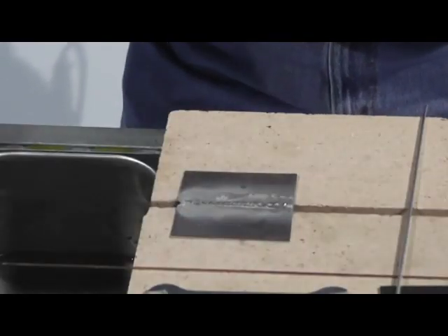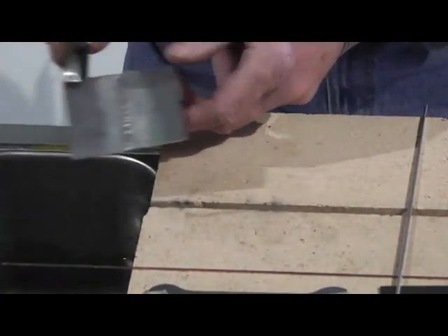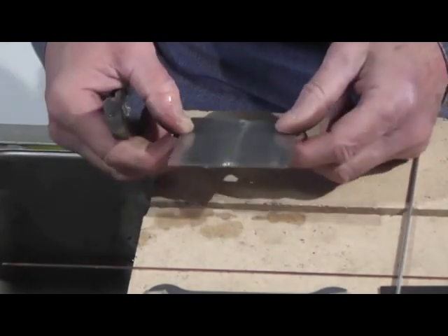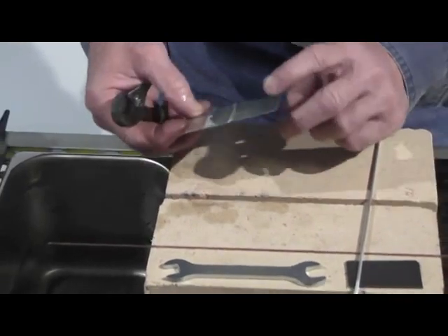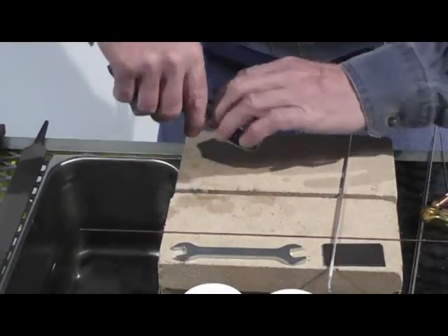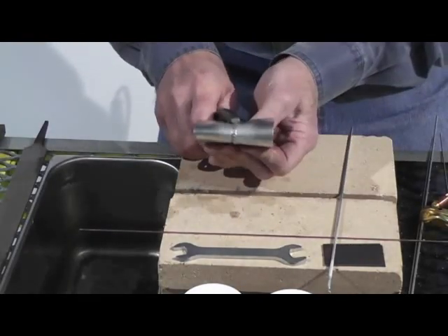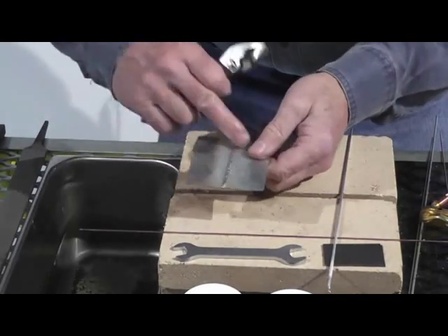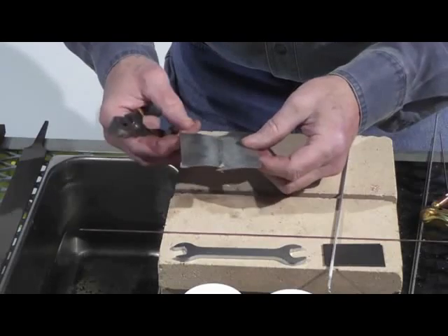You always want to wash that flux off after welding. Notice with just four pounds of oxyacetylene, just how nice a weld you get — 100% penetration, very little distortion. You can actually hammer weld, shape, form, and move that metal. So for body guys, this is an excellent piece of equipment, because with TIG or MIG — if you weld with electricity — you can't do that. That's a self-annealing weld, and that is the strongest weld on the market.